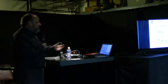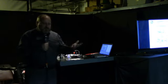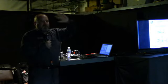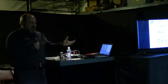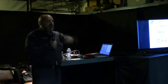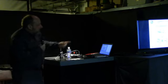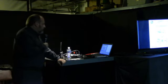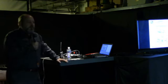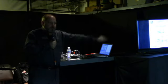So here's an example of the DSTAR network. The basic system, of course, just like any repeater system, you can put this thing up on a hilltop and it acts like a repeater, and you can talk. The radios can talk simplex in DSTAR mode. They can talk through a repeater to another repeater user in DSTAR mode. They can also link repeaters, and this is kind of what this is showing. You can link repeaters really to anywhere else in the world. You can link repeaters, or you can link a single radio over that connection.